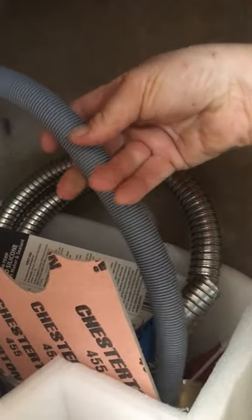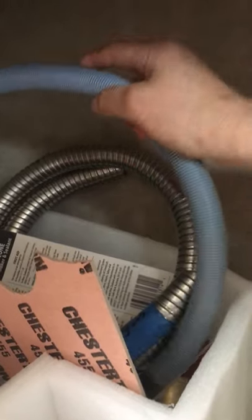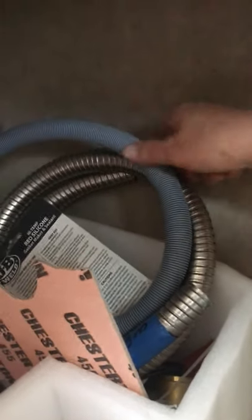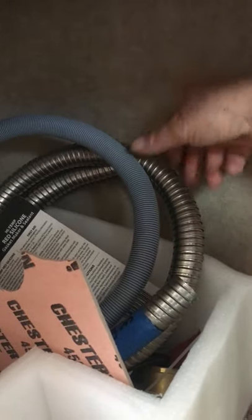So that's good. And the combustion air tubing, that can be a reasonable sort of radius, and that's rated to 150 degrees, the Italian stuff. And Bunnings, pay a little bit more, $35 I think for 5 metres.